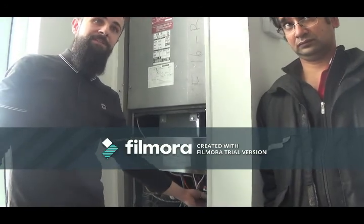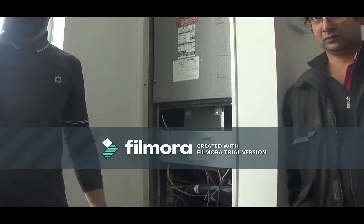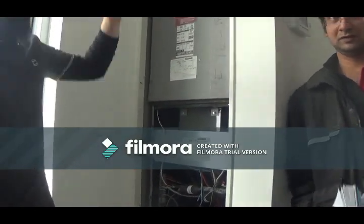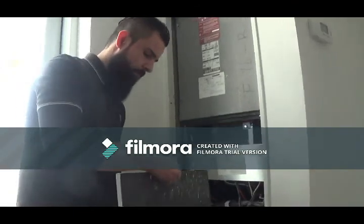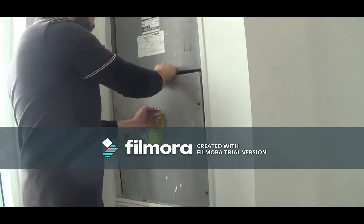But this is 160 PSI, and the water temperature will burn your hands. Usually when you see water on the floor, it's not that. It's the drain pan. If you see water here, it could even be coming from somewhere else. You should isolate this fan coil riser. This one is riser 13, R13. You should be familiar with your risers.